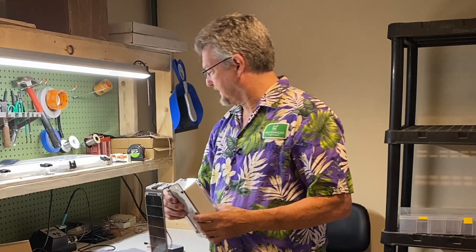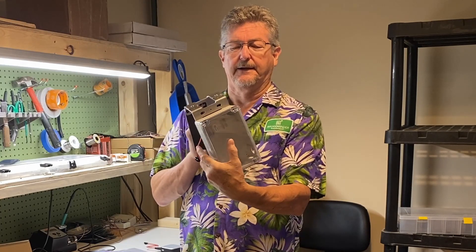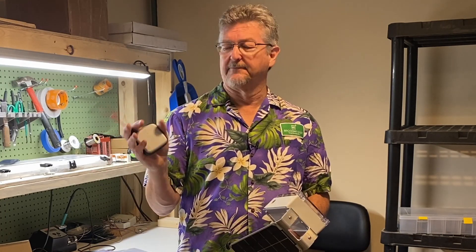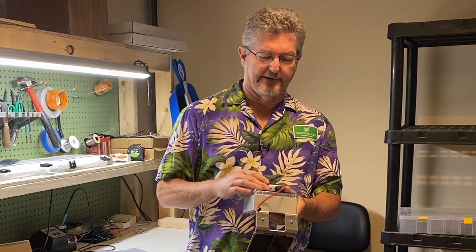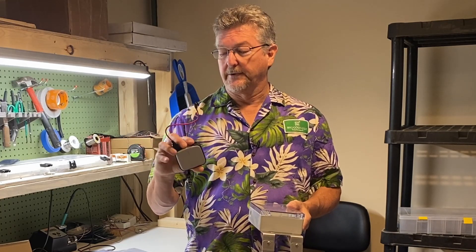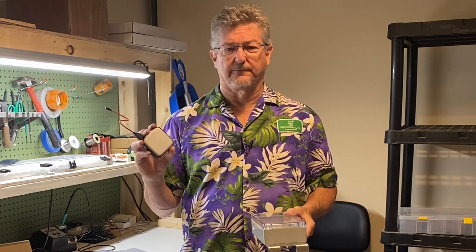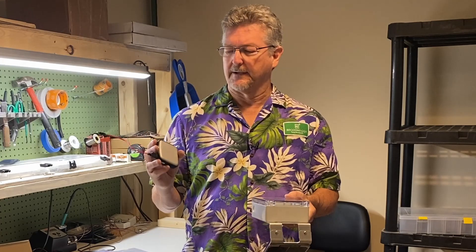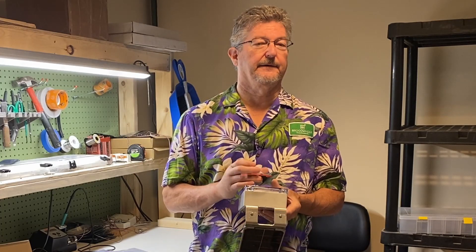For our cell units we have a solar panel and a bigger box, and we really like the components made by Voltaic — V-O-L-T-A-I-C. They've supplied us with a lot of solar panels and they are very much into the Internet of Things and DIY sorts of things. We use — I think it's called the V25 — for our cellular, and you have to be careful with power usage. It's a little complicated to figure out, but you can do that, or if you want a bigger one you can get larger solar panels and power about anything you want out there.